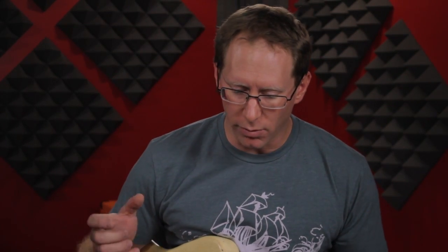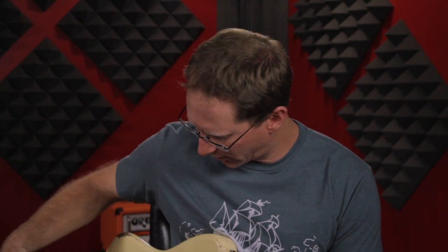And so, you're probably watching us on YouTube, and you've probably heard other people talk about why exactly it is. So I'm going to give you the 3rd grade version because that's what most of us really care about, right? You really don't want to go through the math of it, do you? No. It's a lot of math. Yeah, it's stupid. So really, as it pertains to guitar playing, if you don't have any buffers in the signal, whether you have a 10-foot cable or a 20-foot cable, you're always going to lose some highs because of the high impedance coming from a guitar. With it being high impedance, that cabling actually takes off a little bit of high end for every foot of cable.